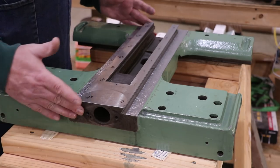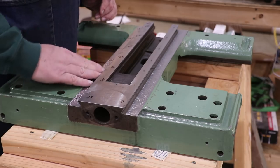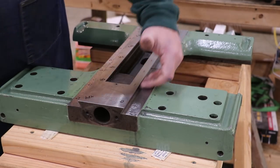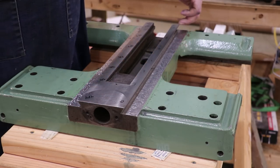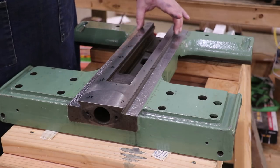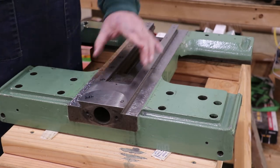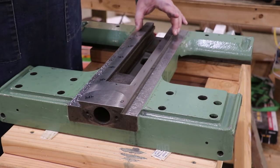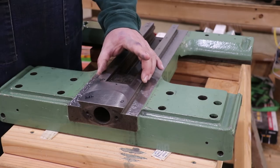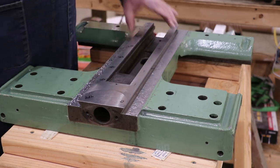I don't think that's the case, but we're going to check it out. If there is any problem we're going to scrape that out, remeasure, and then start scraping the dovetail on the other side. This is probably the most critical thing - we need these measurements to be exactly the same all the way down because the cross slide is going to be sliding on this. If it gets wide right here that means it's going to be real tight coming through the middle, then loose on the end, so we want to make sure that's really good.